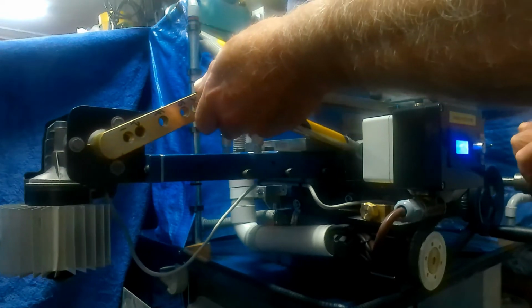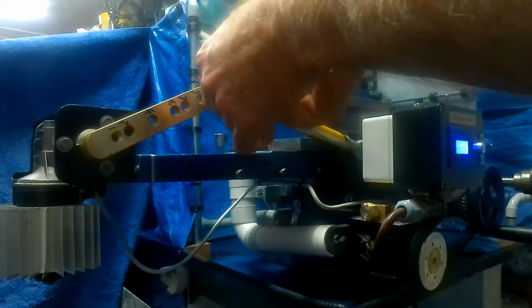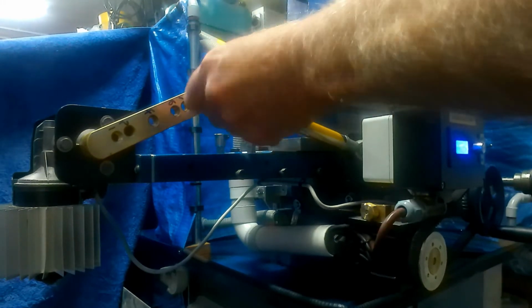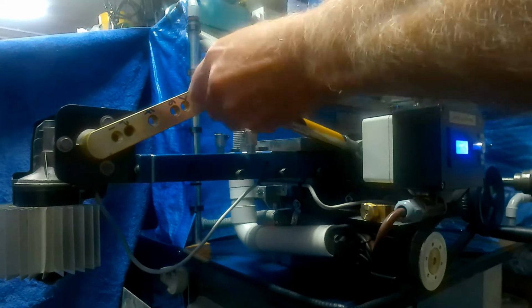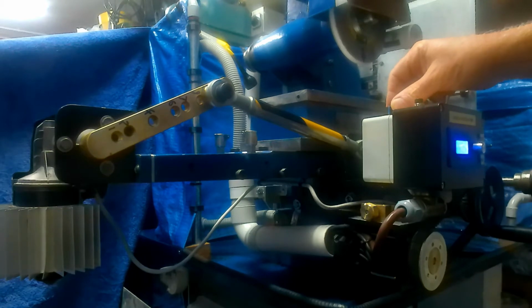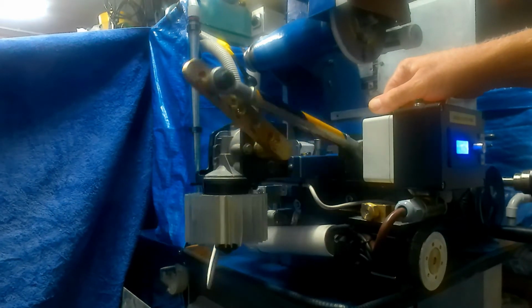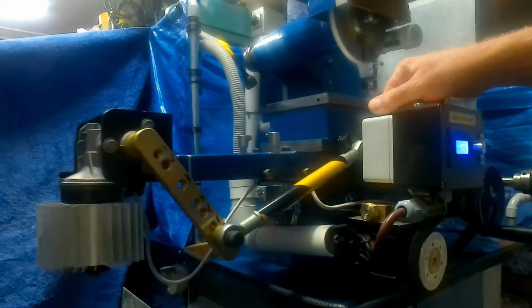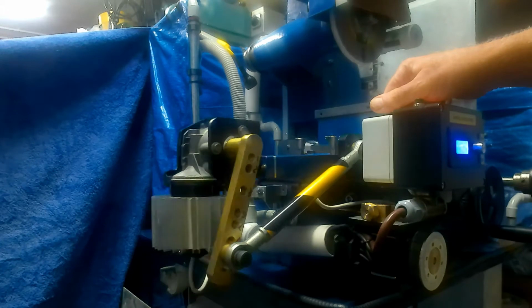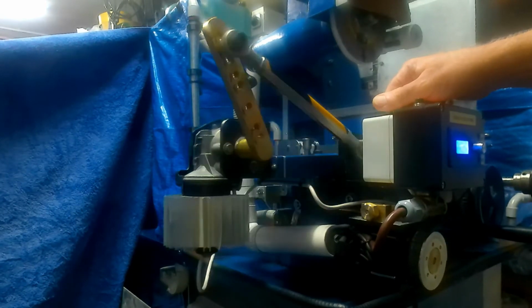Okay, right, I'll move it out to there. That's now going to give us a 10-inch stroke. So it's just as simple as that. Just swap it over like that and switch it back on, and away we go, and we now have a 10-inch stroke. So very useful. That certainly saves the arms, this constant cranking back and forwards.